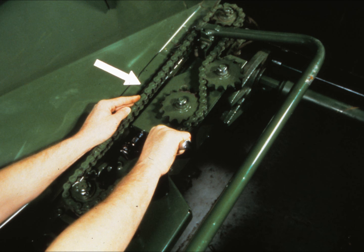The second adjustment is knife chain tension. Loosen the two nuts, then tighten the adjusting bolt until a 20-pound force applied midway on the left-hand side deflects the chain between three and nine-thirty-seconds of an inch, with three-sixteenths of an inch being just about perfect. When done, torque the nuts to 85 foot-pounds or 115 Newton meters.